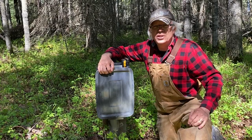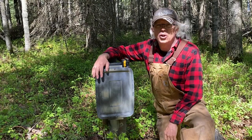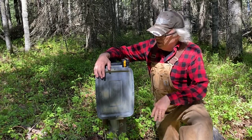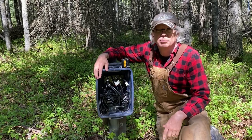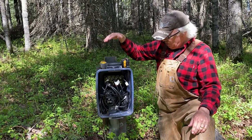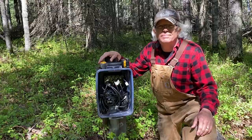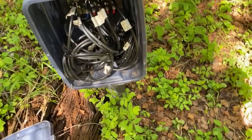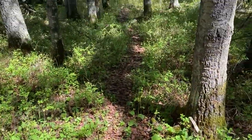This is what I call the East beverage box. I have two of these; the other one I call the West box. Just a cheap storage bin from the home building store. I'll put a couple of screws to hold the cover on — it just helps with weather protection for the switch box which is mounted inside. Coax and control lines come up from below, just dug in and hammered in a 2x4 and screwed it to that. From the switch box here I've chosen to trench the main coax feed line together with the cat 5 control line back through the forest.